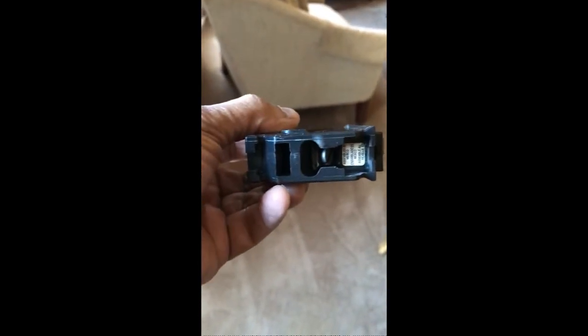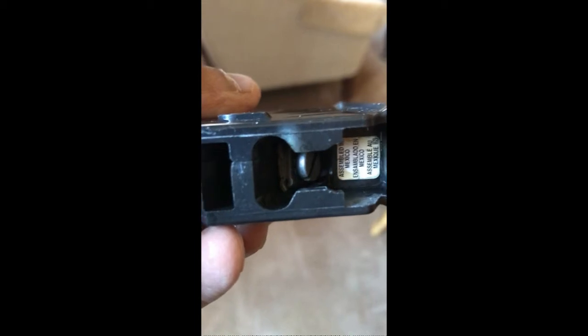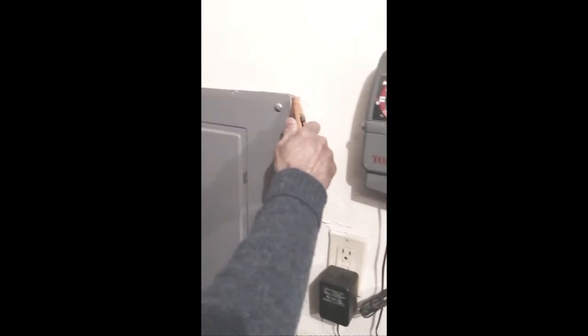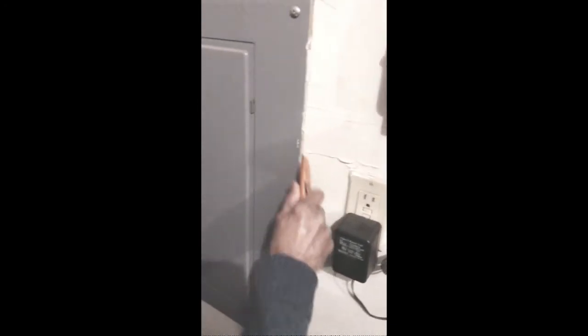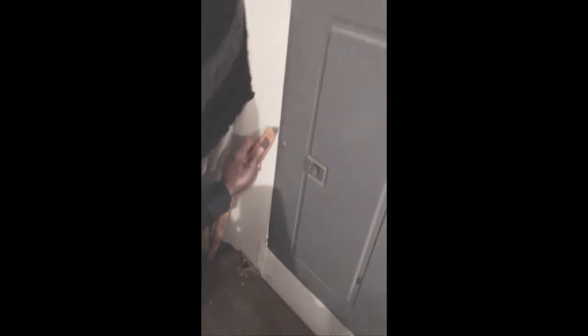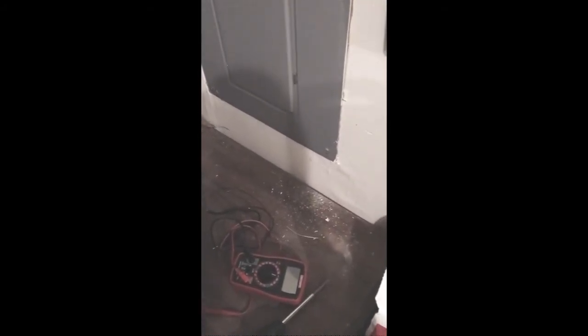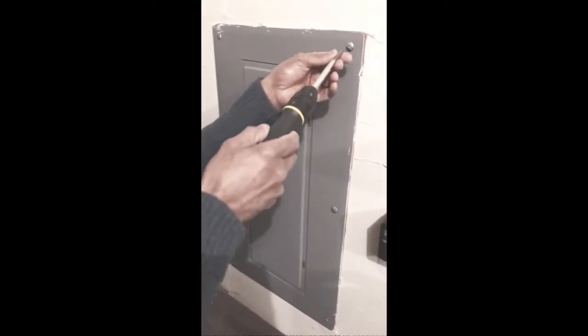The main thing is to learn how to insert the circuit breaker into the panel once you are ready. The first step is to remove the panel cover. This involves loosening up the side of the panel from the wall, since over the years paint may be stuck to the panel or it may have been installed with glue — so it's a good idea to loosen it up with a utility knife. Then take out the screws that are holding the panel.